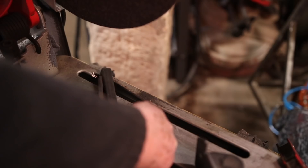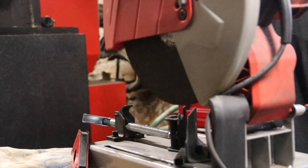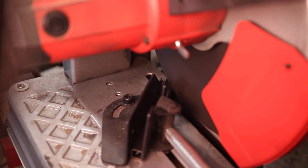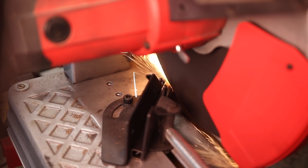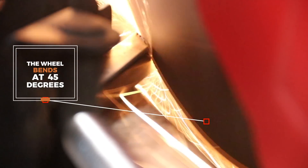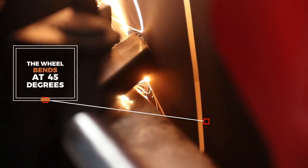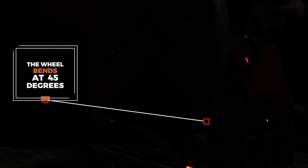But today I'm having a bit of a problem. Let's see if you and I can get to the bottom of the flexible cut mystery. The issue I'm having is with a chop-off wheel — the abrasive type. I'm not getting a square cut on this narrow gauge square tube stock when I'm cutting it down at 45 degrees, because the actual blade twists.